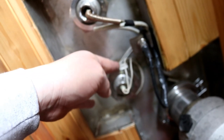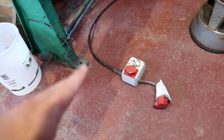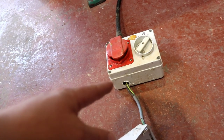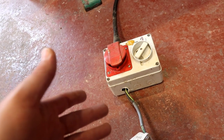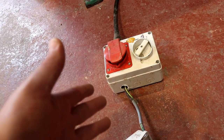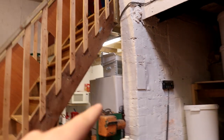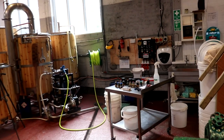I'm going to incorporate that float switch system also in the SS Brewtech pots. Now, I'm actually quite reluctant to piggyback a single-phase line off of this, simply because this is a 16-amp three-phase cable - that means it can carry 16 amps spread across three phases. Pulling 16 or 32 amps just on one of those phases, I don't think the cable is heavy-duty enough - it only looks like 2.5mm to me. So I might just run alongside it a 4mm square cable for the single phase and put a 32-amp socket on the wall to carry a single-phase load for the pilot kit.